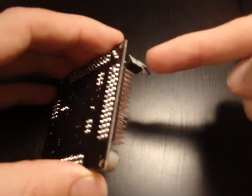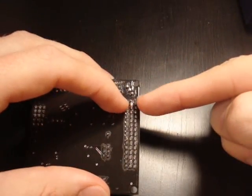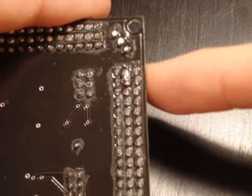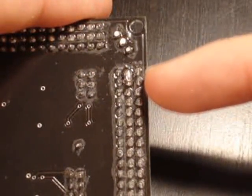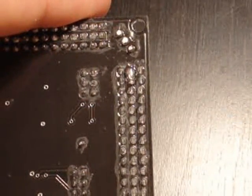There are many reasons. So you flip it over, you'll notice the voltage regulator is here, and if you look really close up, there are two pins. These two pins are shorted, so what you need to do is remove the short, and then you could use two batteries, and I'm going to show you how to do that.